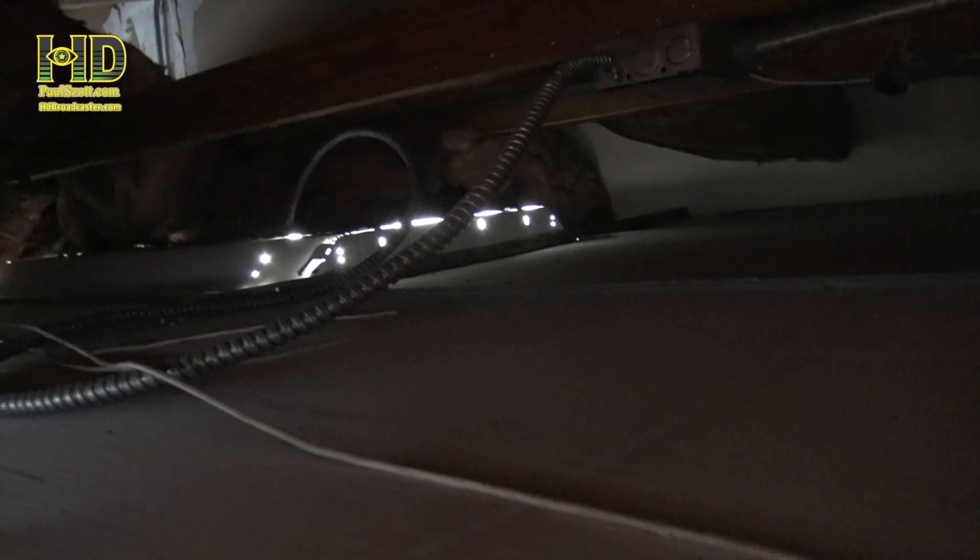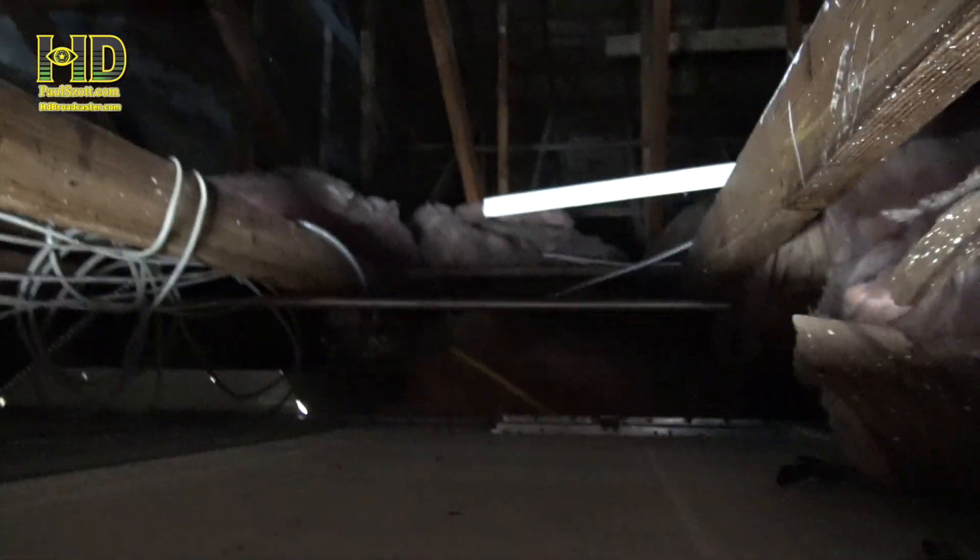What is this here? That's the old lights that used to be here. Is that legit to just sit there like that? No. That right there needs to be disconnected or we're gonna have to fix it. Make it actually work, or just put a plate over it? That wood is not in a support, so that box is gonna have to be moved and put somewhere else. We could just strap it to that piece of wood right there. Put a blank plate over it.